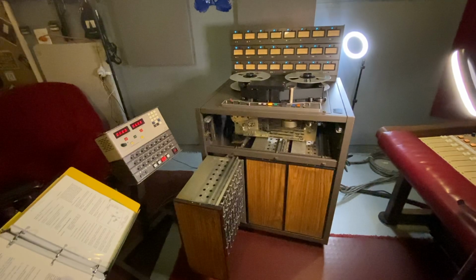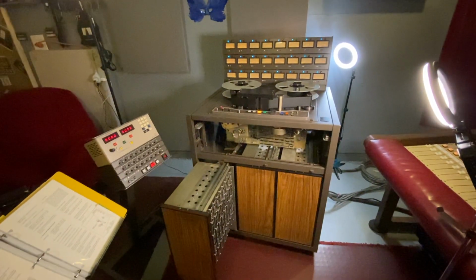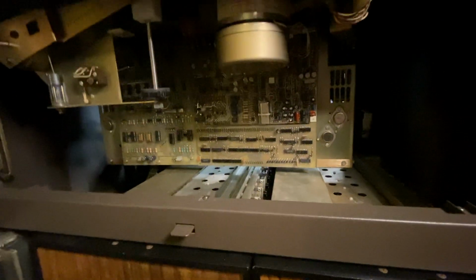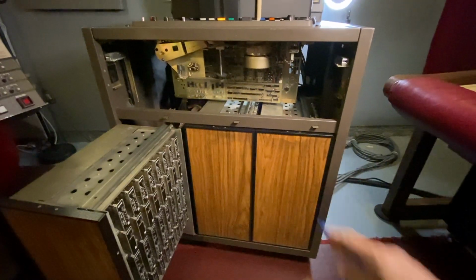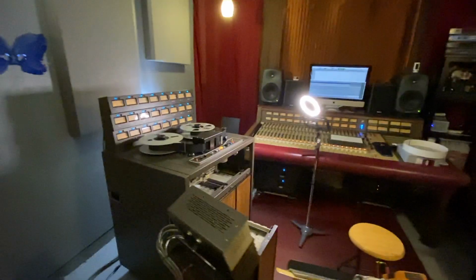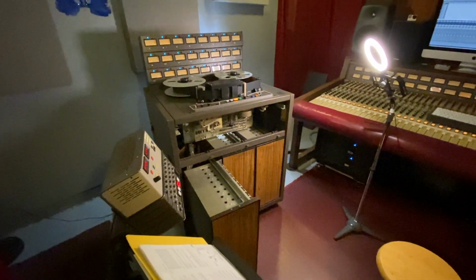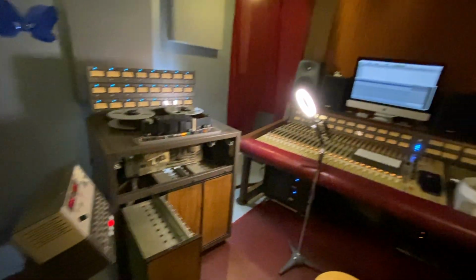basically, I think I'm at 85% of this machine recapped right now. The complete motherboard, all the daughter boards, the complete transport has been recapped. Most of the channels. I got some more channels to recap. I did the back planes. All the boards down here were all recapped. Brand new capacitors. And I noticed a difference when I recapped it. It was just more steady. I was able to calibrate better as things weren't fluctuating. So you should recap it.